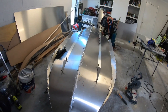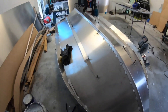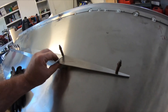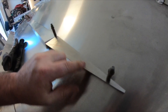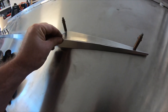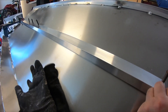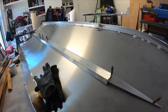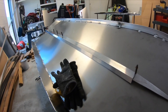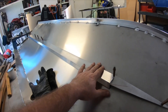I've been working on these reverse strakes and lifting strakes here. What I'm going to do with this one is taper the strake off to the nose, weld this piece in here, and then I've got another little piece to weld in there as well, which will finish off the end. Then I'll weld the whole strake in. Essentially it's going to improve the strength of the hull through the centre and also give some lift in the water on this flat surface.